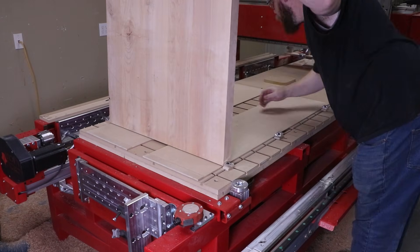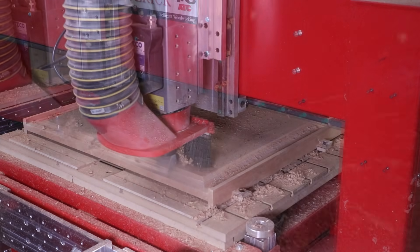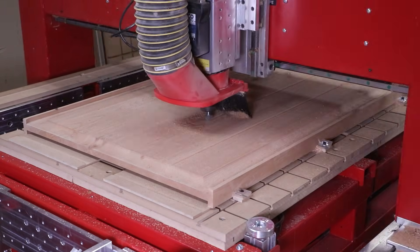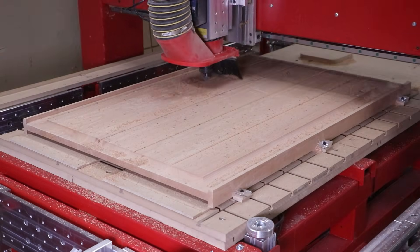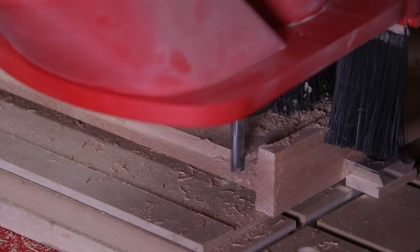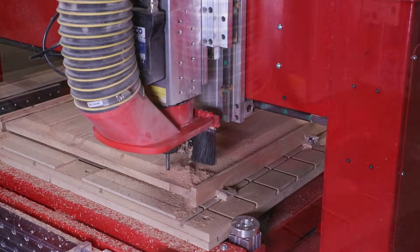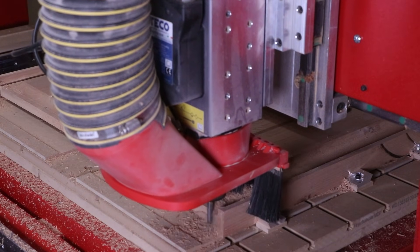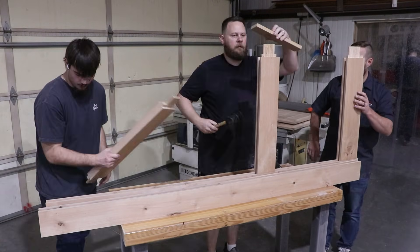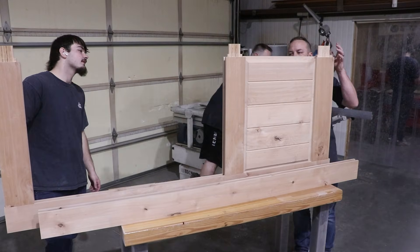So when I flipped it over to the second side and repeated the same process with that rabbet cutting around the entire perimeter, it actually removed a little too much material, so the panels were a little loose when assembling this with the door. Next time I'll have to come up with a different technique to make those a little bit more accurate. This same process was repeated for both panels, and I could perform a dry fit to see how this all came together. The mortise and tenons fit beautifully using a ten-thousandths allowance with the CNC machine. The raised panels slid in, but they were just a little too loose in the center section and left a little gap.